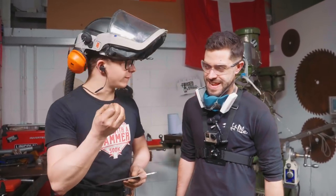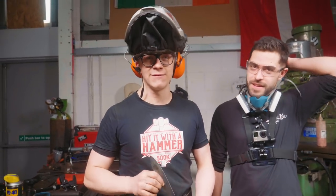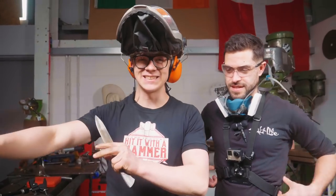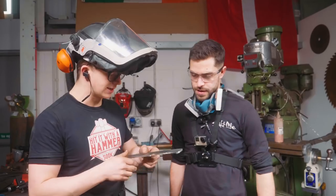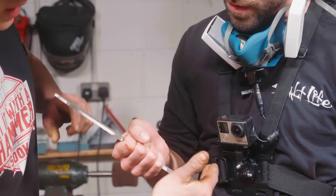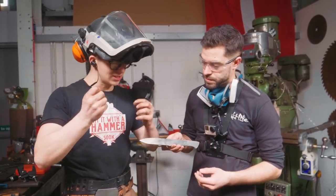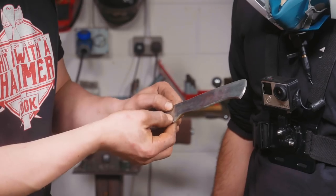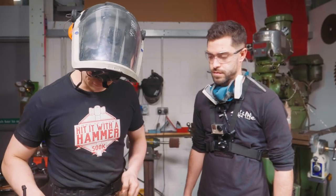He's done a fantastic job of grinding it. I was getting the stuff flat — a belt grinder like that isn't amazing for getting things perfectly flat. He kind of directed his own profile grinding, working out the profiles he wanted. He changed a couple of things from the forging — a bit more of a bulge in the handle originally, and we cut it a lot shorter than it was. We cut that nice angle on it — it's a cool shape. He's made this thing fit his hand and the feel that he wants. An important thing was making sure we remember to keep the choil area proud, because he really likes having that handle come all the way down to that choil before we do our grind.